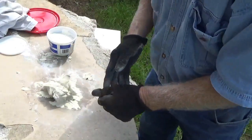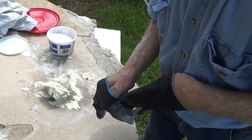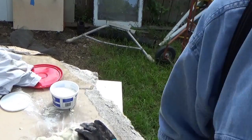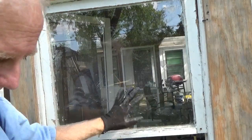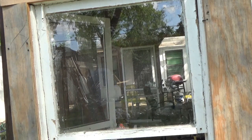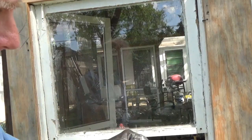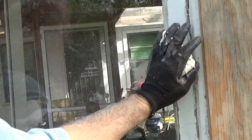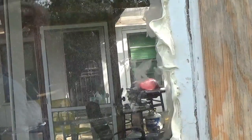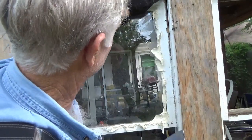Alright, I'm going to put some glaze on. This is probably where I'm going to get a lot of emails from people saying I'm doing this wrong, but I've been doing this for the last 40 years and never had anybody call me back. There are two ways you can do this. Now, when you buy a putty knife, be sure you look for a putty or glazing knife. There are two ways I do this — one is I really just shove it in there. That way you get a good seal and you shove it in those cracks anywhere where there's a crack.